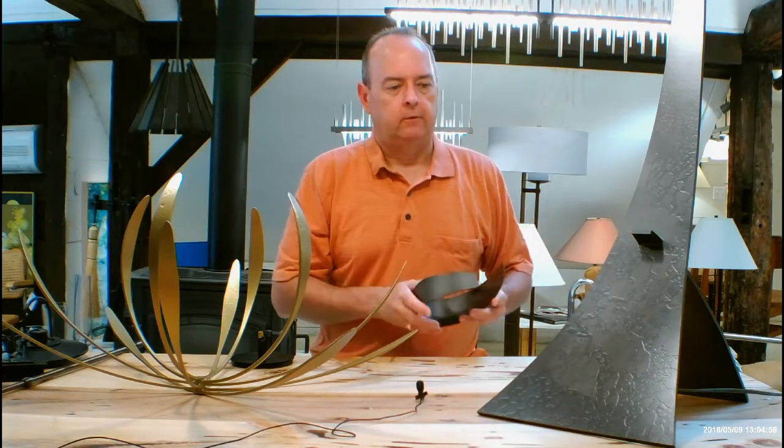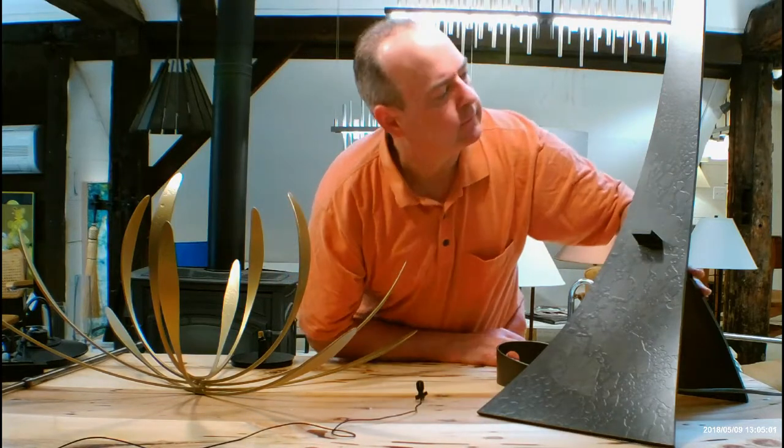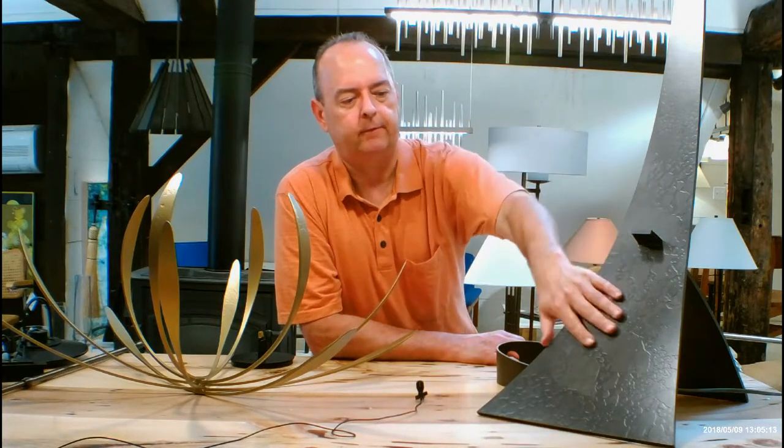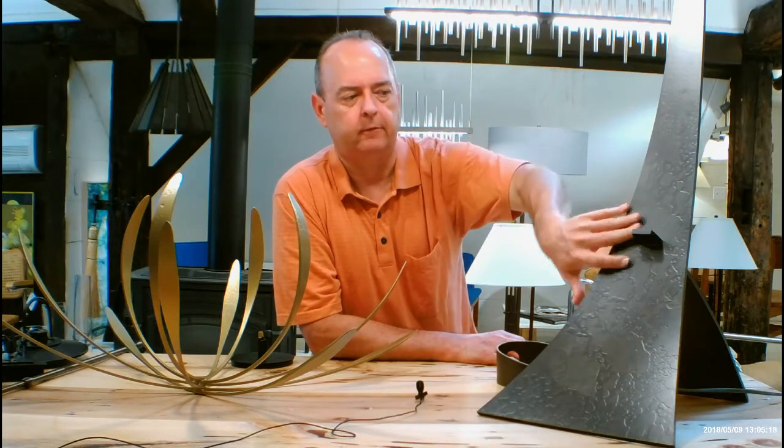How's that sound? When you're on our site and looking at those A's, you can see there are some translucent finishes, and translucent finishes are going to be a window to the metal. This is dark smoke, I believe. Yep. Dark smoke is a translucent finish. Mahogany, bronze, dark smoke, and burnished steel are semi-transparent, translucent. They're a window to the metal, which means that if you have that scale or slag on there, you're going to be able to see parts of it. Now, different fixtures have different parts on them, obviously.